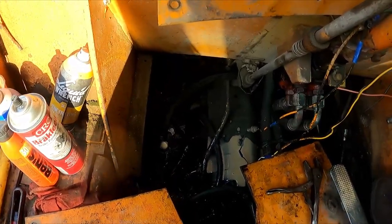Oh, geez, that was more than I wanted to come out of there. Okay. Well, remember when I said it could just be a stuck relief valve? Yeah. I mean, that's a lot of flow for not making pressure. I think we're making pressure. I think we got a stuck relief valve, which is a relief.